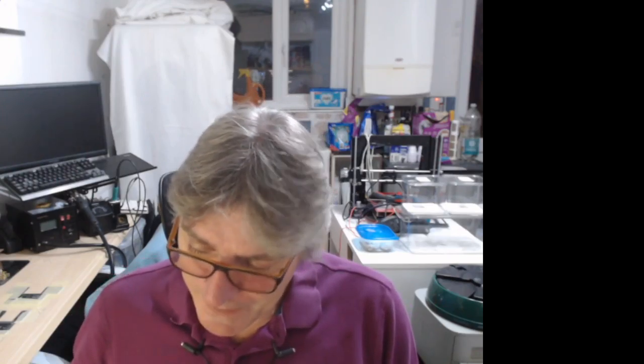One of the problems with this is the surface mount connectors have a lot of plastic on them, so you can't reheat the board very easily, because it will eventually melt, particularly if you're using the heat gun. I hate it when you have components that have lots of plastic on them when you're using the heat pencil, because you have to be really careful not to melt them. They will reflow okay once, but if you start doing multiple reflows and then heat pencils, etc., it ends up a mess if you're not careful.